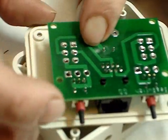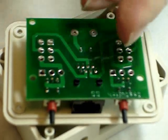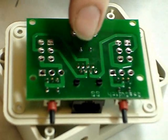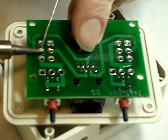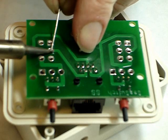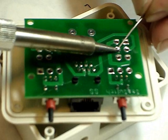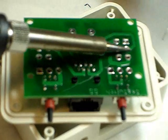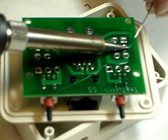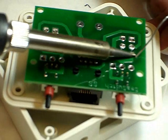Put this upside down. On the first couple of joints, make sure that the circuit board is pressed flat — otherwise the switches will be at a funny angle. Do a couple of the pads and then check that everything is still square. Quick check — everything looks good. Continue finishing up the remaining pads.